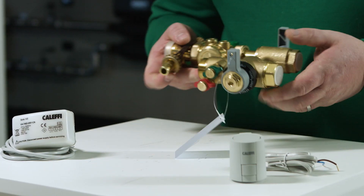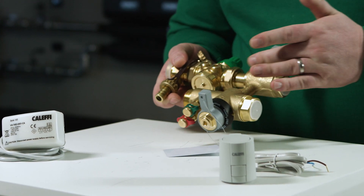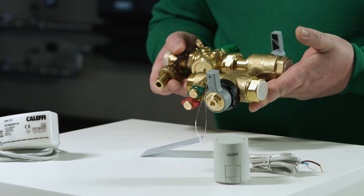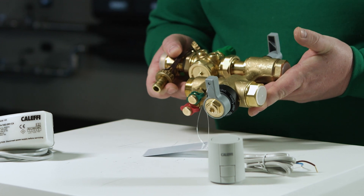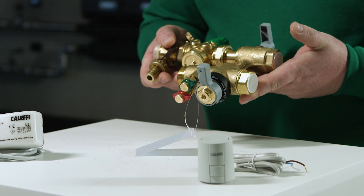We will now talk about the functions of the three-way valves. We can now bypass the terminal unit for initial flushing or to maintain circulation during maintenance, complete shut-off for maintenance, or standard function of the unit. Inside the inlet shut-off valves there is a strainer for unit protection.